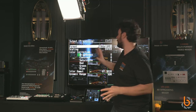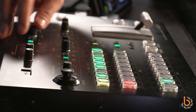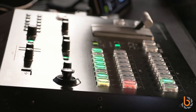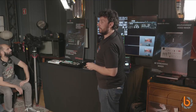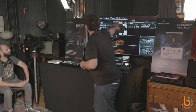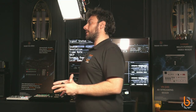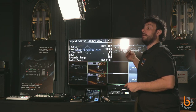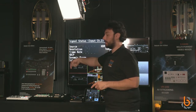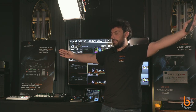Internally the unit is working in 4K. Going to inputs and signal status: input number one is telling me it's in 4K resolution. Input number two — my computer — is telling me it's 1080p. Because the internal resolution of the V1600T is 4K, the computer on input two is being upscaled from HD to 4K, while input one is just passing through.